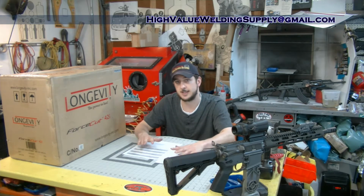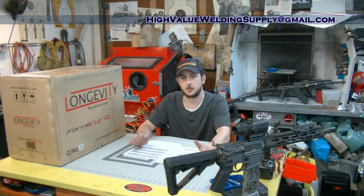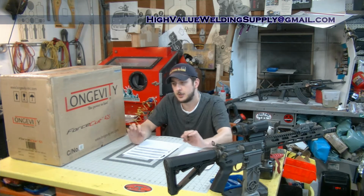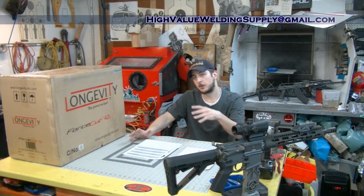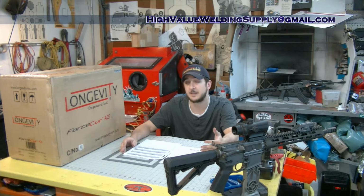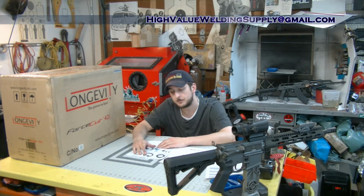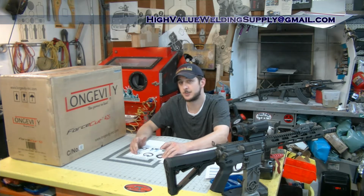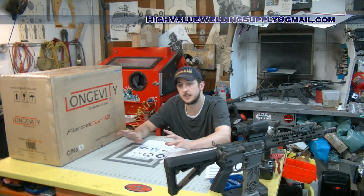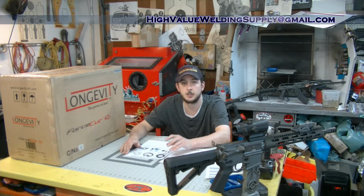This is such an intelligent welder. It's 21st century technology. Very, very good stuff. You're looking at the newest circuitry. It's IGBT inverter circuitry, the latest, greatest stuff out there. It is pilot arc controlled. You get your ground and your torch, and this runs a PT60 torch, which is a high-end, nice torch. Very, very good torch with readily accessible consumables at any of the stores or companies that sell plasma cutter stuff.